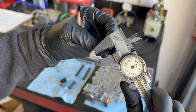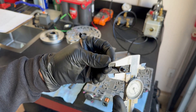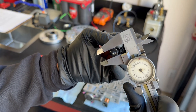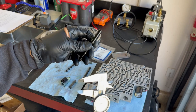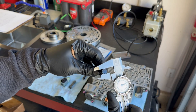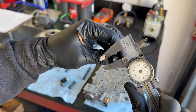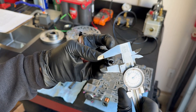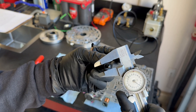When we measure the diameter of the balance spool on the legitimate valve, we get 394 thousandths of an inch, and the outboard-most spool measures 435 thousandths of an inch. When I measure the suspect valve, I'm getting 390 thousandths of an inch on the balance spool, and the outboard spool is only 430 thousandths.